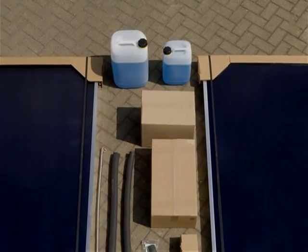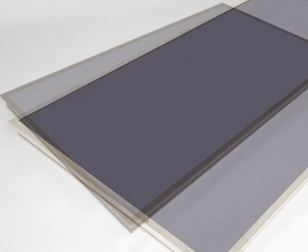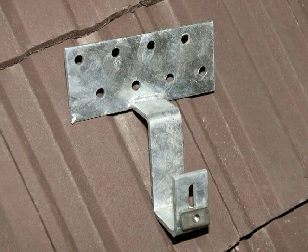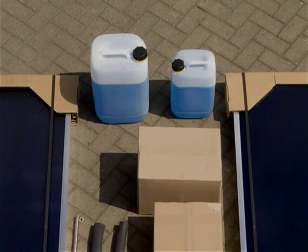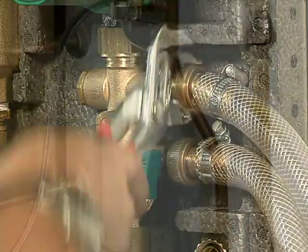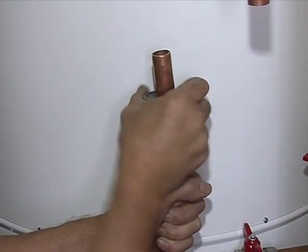We'll look at how you can take advantage of this very lucrative, in vogue, new business opportunity. The components needed for each Grants solar heating installation are supplied in an easily ordered kit form. Typically, a Grants kit will include two or three solar collectors, or panels as they're sometimes called, an on-roof fixing kit, roof anchors, a solar pump station, a system controller, an 18 litre expansion vessel, sufficient solar fluid to fill the system, and all the other specific fittings and connectors needed to complete the installation. We can supply the twin coil cylinder too if required, and of course you'll supply the copper piping and plumbing expertise.